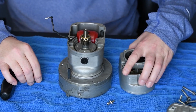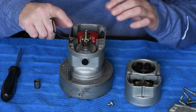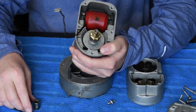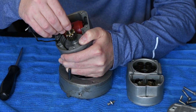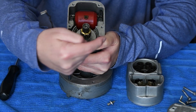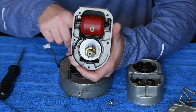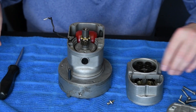When we go back together, I'm not going to go any further than this as far as our magneto teardown goes. I'm not going to pull the coil out or the rotor out. But there are some things I want to talk about regarding this gear when we do our reassembly. When we install our cam, it is keyed, so it only goes on one way. If we look at the arrow that is on this cam, the arrow is pointing in this direction — we are right-hand rotating, it is a clockwise rotating magneto, and we would view that from the drive end of the magneto.